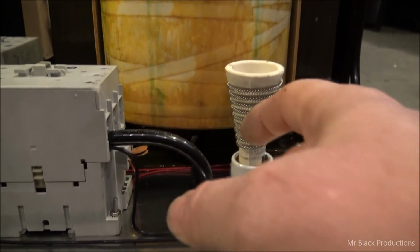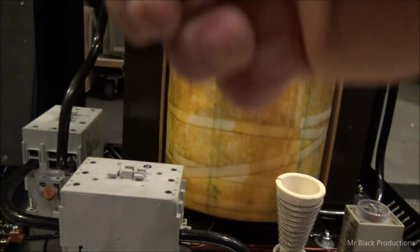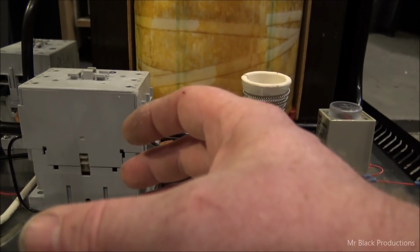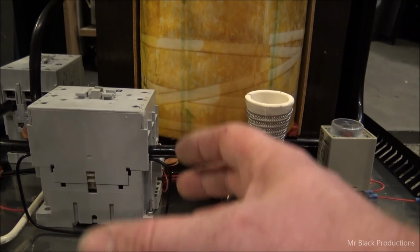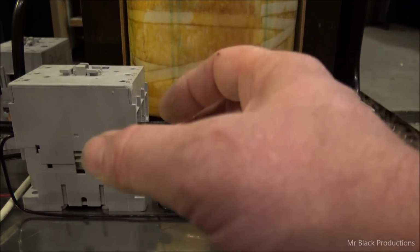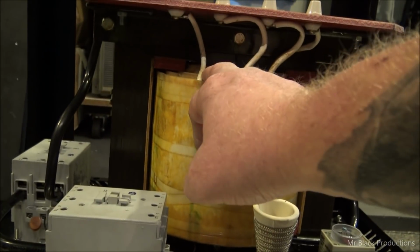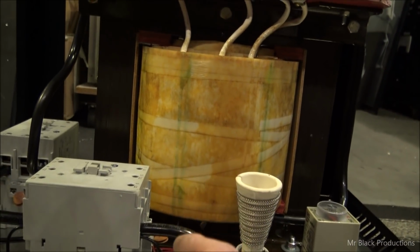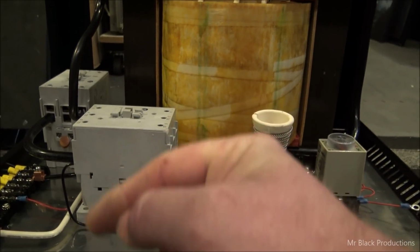So, there's a short that's present all the way on the other side of the rectifying diodes back at the electrolytic. You have a resistor that pulls down the electrons out of your filtration cap to get rid of the high voltage to make the circuit safe when the amp is not in use. It sees that capacitor as a short. Well, the transformer doesn't know anything about it. The transformer doesn't care. The only thing that really cares is the diode bridge. That, and then the plates inside the electrolytic.